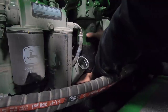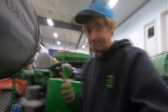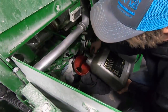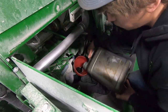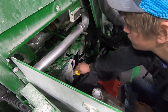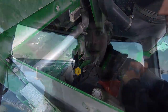It's so warm. It's a green filter because it's brand new — that's interesting. So this is the first oil change on it. I'm going to fill it up with Schaefer's 15W-40, about 100 hours on the engine oil. That's one thing I don't like about Schaefer's oil — it looks black when you put it in. A little bit over full, but that will be okay because when it starts a little gallon will go into there.